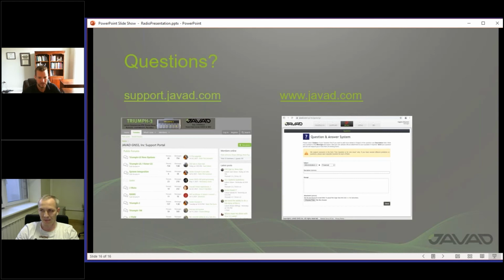Yeah, I can talk about this. So this really depends on how good the cell coverage is and the location you're trying to survey. If you have good cell coverage, like 4 bars of service, then typically the cell connection is going to be the preferred and better method of communications. The delay is going to be smaller and just allows more data to be transmitted. But UHF is used for areas where you don't have good cellular coverage. So really it all depends on your cellular coverage.